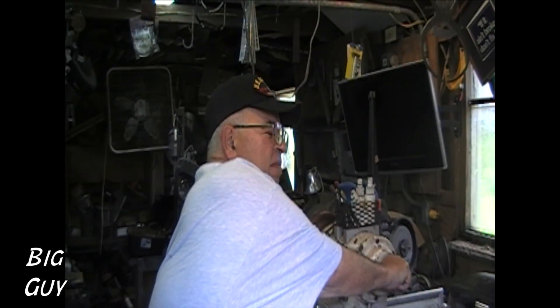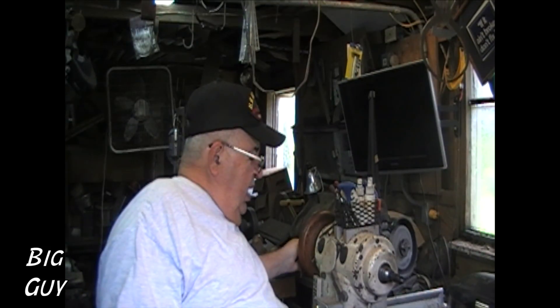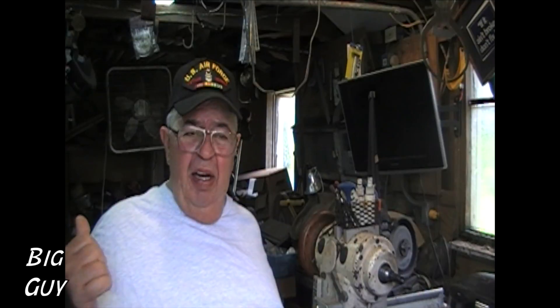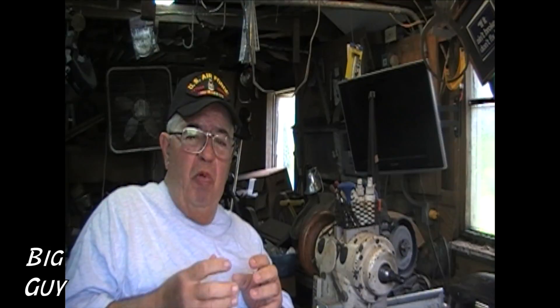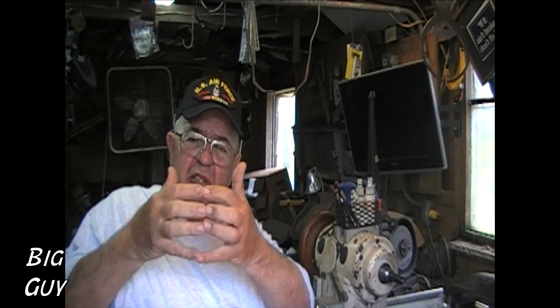I don't want to do the videos with the attitude of 'look what I can do, not like you can't do it.' What I did there: I took a standard kit for doing a pepper grinder, and where it shows you to put the neck fitting where one goes into the other, I just didn't do that step. I replaced it with a piece of Corian — it can be hardwood either way — and that was so that I didn't lose the grain match. When the things came together the grain match looked right. If I took an inch out of it, the grain match might not. Sure it's picky, but when you feel you can do that and you want it to be that way, I found a way.